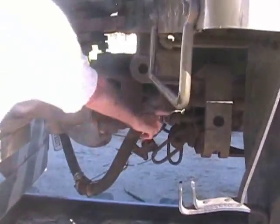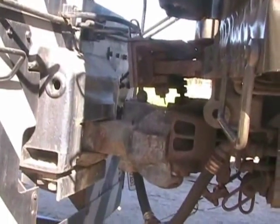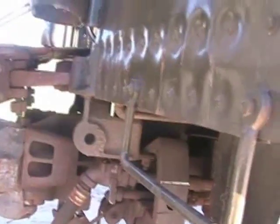We have dangling equipment. Down here you can see where this is cut off from the rest of the train. When we did engineer for an hour, we had to move this all out and run it down the track. When you get that uncoupled, there's a conductor's hose that attaches to that hose, and the conductor or brakeman coming down the hill can make it set from back there, or just dump it and stop the train. We have our skate — usually put a flag in the back of it, in the rear.